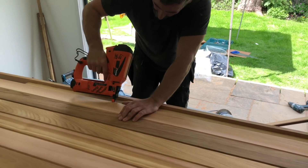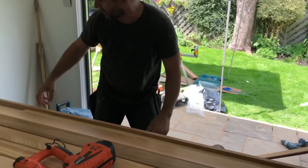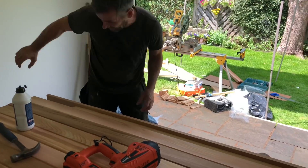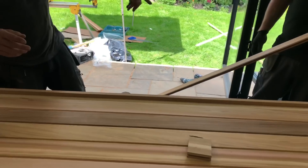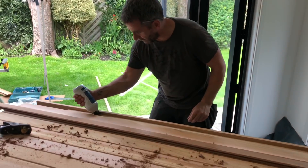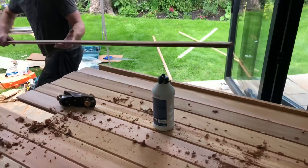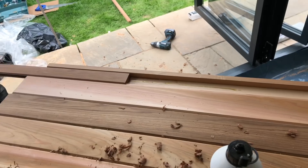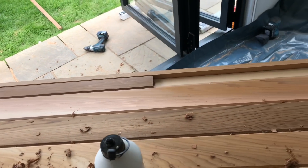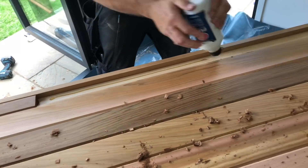What I'm going to do now is measure that gap - I'm going to rip this board down until it fits in. We'll probably turn the door around and slide it up so it goes all the way up, because it might be just a little bit tricky to get in. I'll put a little bevel on that side as well. I'm going to put a bit of glue there - not much - and force it in like so. Once I get past that bit of glue, this is either going to work really well or you're all going to think it's amazing.